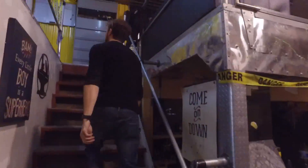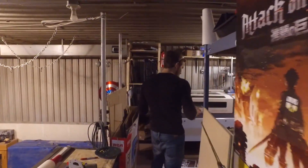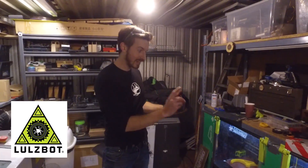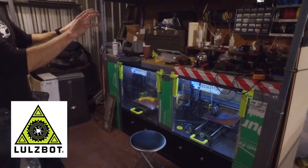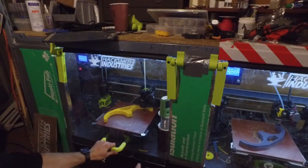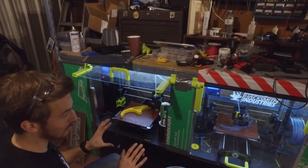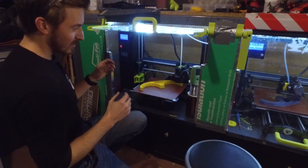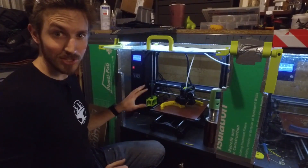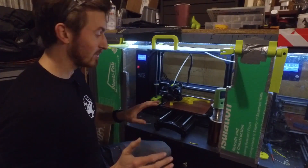Also upstairs, we've been doing a lot of 3D printing lately and we're planning a dedicated 3D printing video fairly soon, but I wanted to give you a sneak peek of our setup. Lulzbot has been sponsoring us and we have a TAZ-5 and a TAZ-6 3D printer. What we've done is put them underneath our electronics and soldering workbench and built a heated enclosure — we have foam and 3D printed doors that slide open. We've got a space heater in the corner and this entire area is heated up nice and toasty, which means you can print giant parts. The problem with 3D printing large parts is they tend to warp if any breeze or airflow hits them and causes the plastic to cool in a non-uniform pattern, but with a heated enclosure you're able to print giant parts in ABS with minimal to no warping.